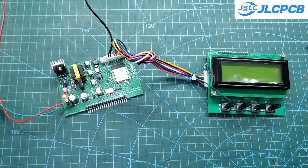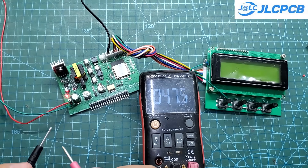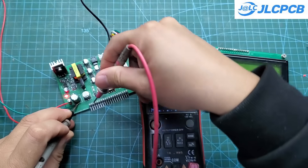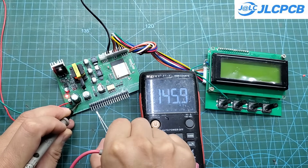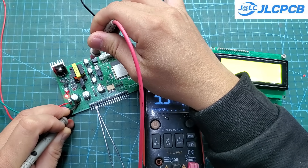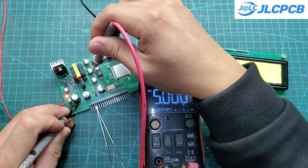I'll apply an input voltage of around 25 volts to this module first, then carefully check all the power supply voltages one more time. If everything looks good, we'll turn on the power for the MCU. The display will only show a welcome message because the MCU isn't connected to the main board yet — it can't communicate with the sensors and can't fully start up. See you in the next video where I'll build the power board and test this MPPT circuit.